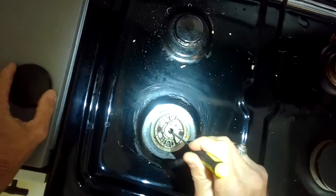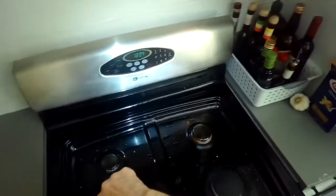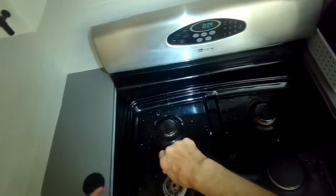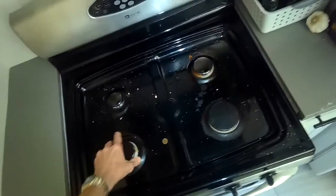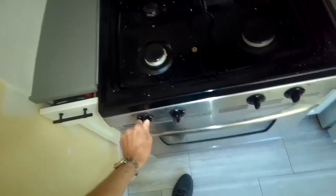This is the front burners on a gas stove that are not lighting. So I took off the burner cap and I put in this awl, pushing it in and twisting it into the little brass piece at the bottom. There's a little hole there, and now when I try it, it fires right up.